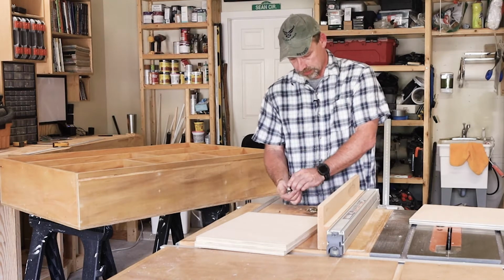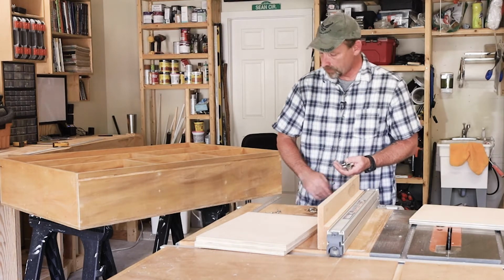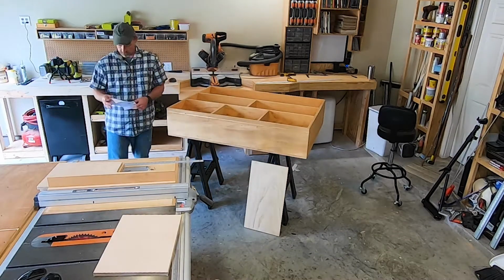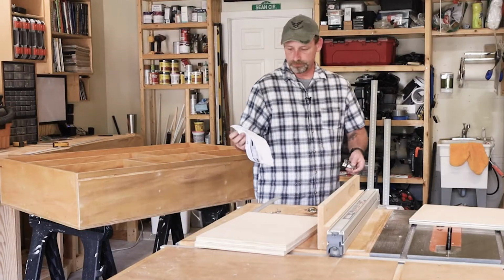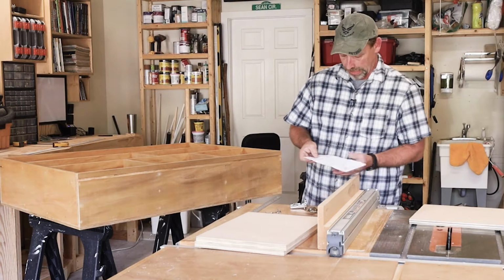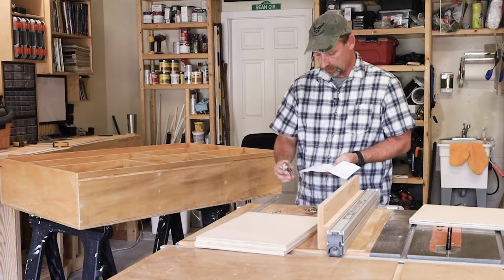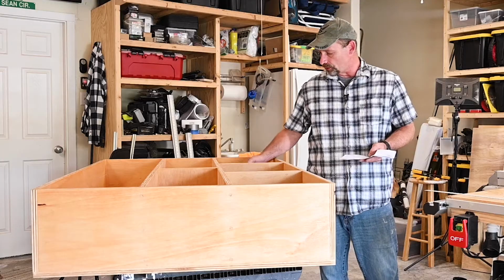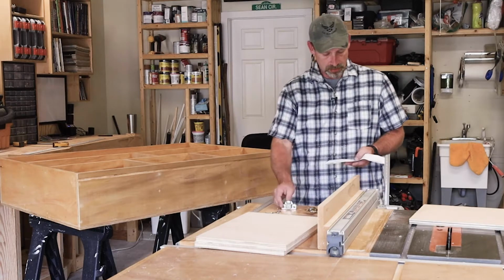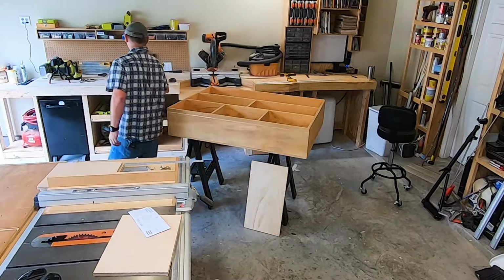So, you know, I just got these at the orange store. You can get them on Amazon or whatever. All right, and it came with these instructions, with a little template you can cut out or whatever. I'm not gonna mess with that. I just went ahead and measured off their template. So it's like 5/8 to the center line of the big hole for the barrel part of this hinge here, etc. So we'll just measure it and mark it, see what we come up with.